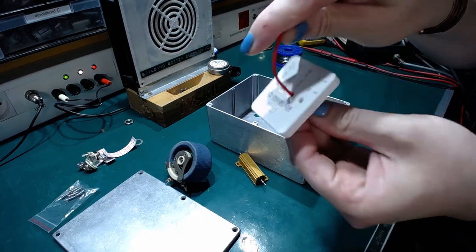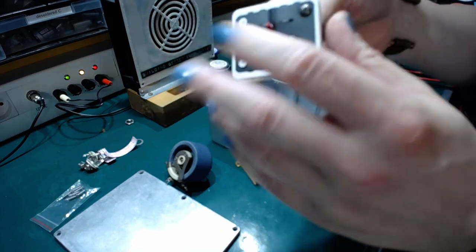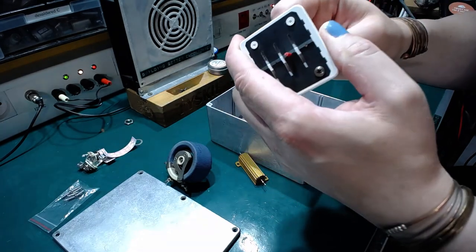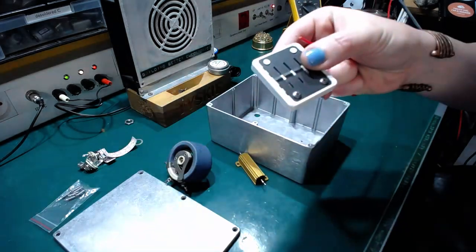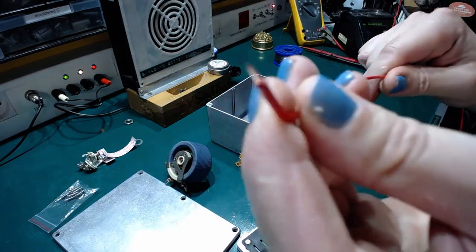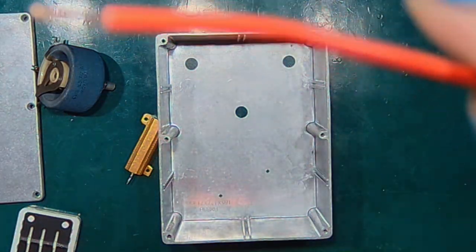Just put the wire through a hole. Then the lips will pinch it, and if you pull the wire back, the lips will cut a portion of the insulation off, leaving a nice and clean surface on the wire. I think I can get a better view on this.